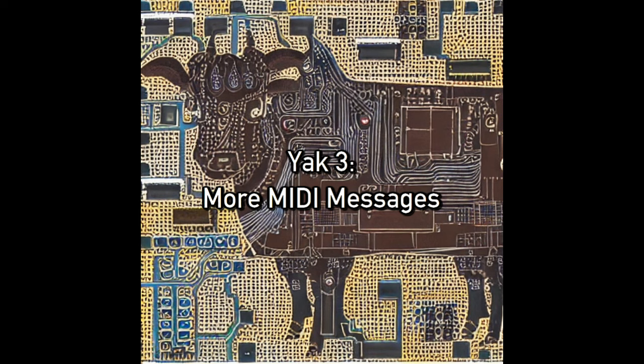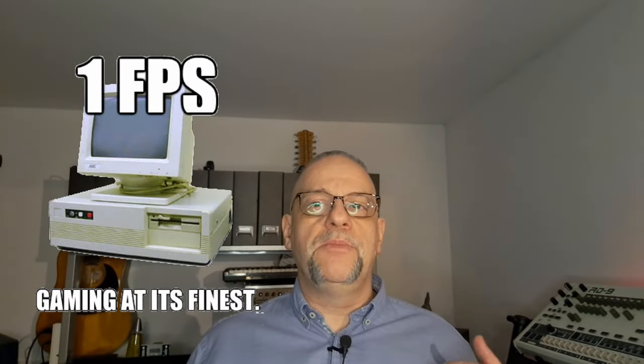There's another MIDI standard for synchronization, it's called MIDI timecode. It doesn't send clocks, it sends times, or rather frames and subframes, where frames refer to frames in a film, like 24, 25 or 30 frames per second. Yes, like your video game. This is because the common standard to sync things is called SMPTE for Society of Motion Picture and Television Engineers, and it uses the frame rate of film and TV to sync things. So MTC isn't to sync instruments, but to sync time-based things like cameras and tape recorders.